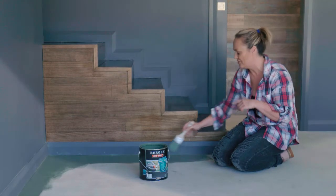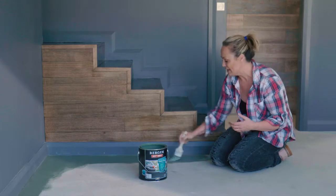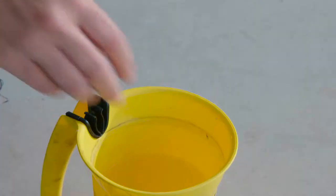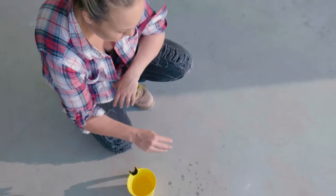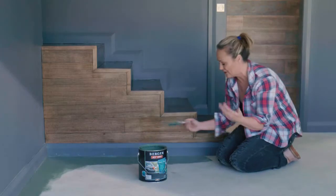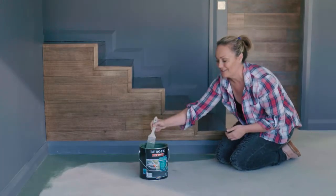There's a little trick to check if your surface is ready to accept paint: flick just a little water onto the slab. If it beads up and stays beaded, you need to do a full treatment again — another acid etch. But if the water sinks straight in, you're good to go with painting.